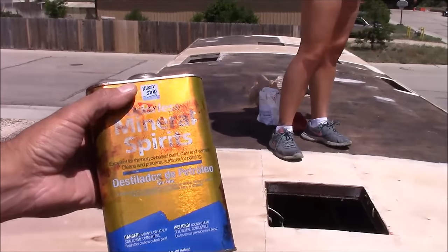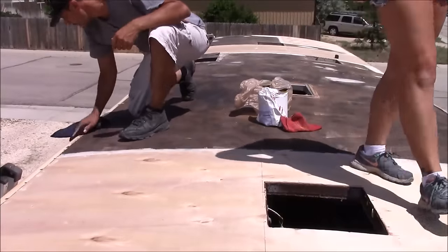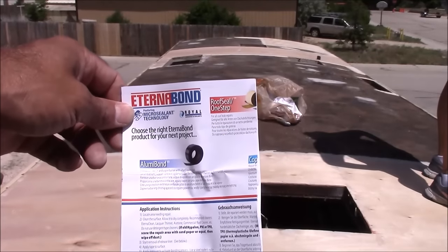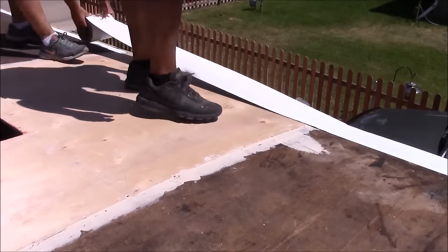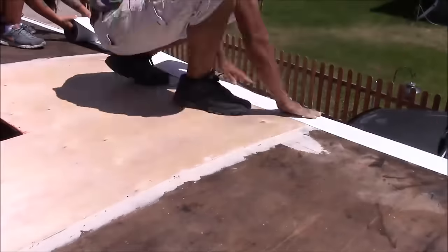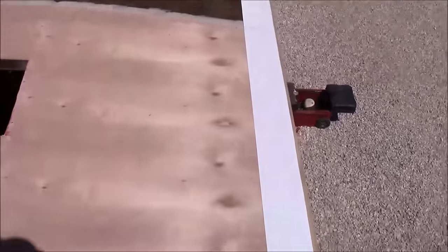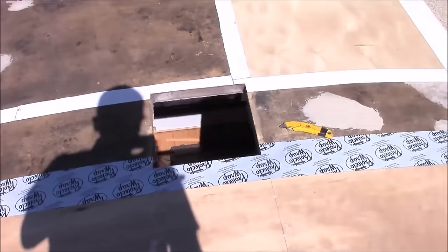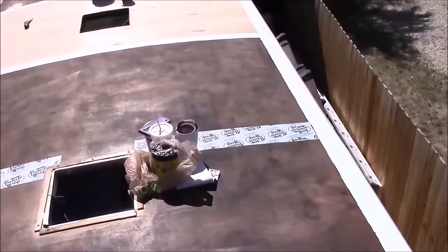Now I'm going to clean the entire roof and prep it so I can apply seam tape. A lot of the old wood is stained black from the previous rubber roof, but that won't affect adhesion — it's just cosmetic. This is a really thin tape meant for all your seams, and it can also seam two pieces of roofing material together. Per manufacturer it says you don't have to do anything with the joints unless there's a gap more than an eighth of an inch, but I'm going to put it on all my seams just to rule out any future issues. The seam tape comes in various widths — this one here is about six inches. I ended up cutting the roll in half for some seams to get double the length, and used a different brand to finish the job with similar properties.